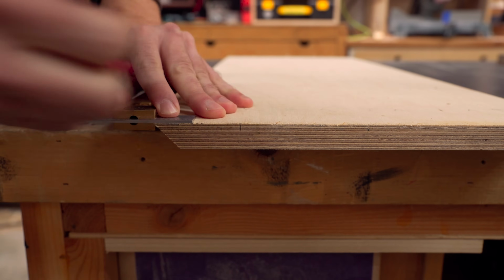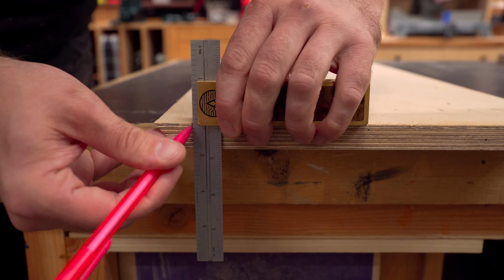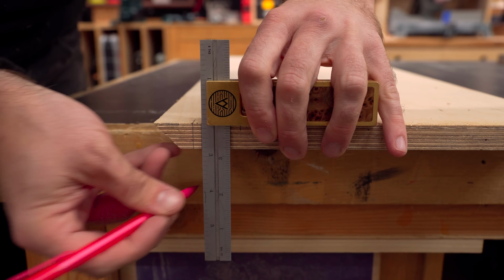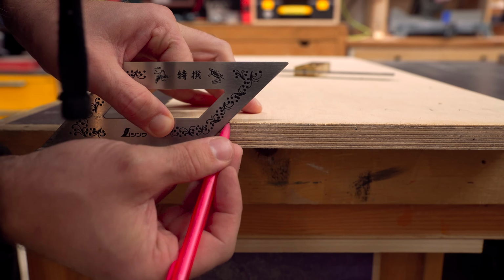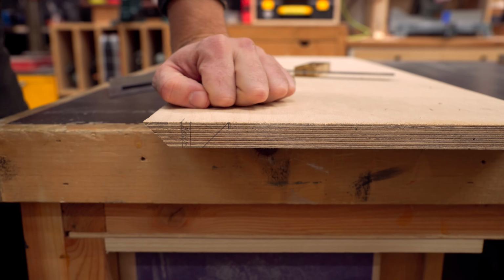With a 45-degree angle on the outside edge, I can start making a couple measurements. Basically, I'm gonna get 2 pieces out of every rip cut. I don't wanna switch back and forth between 90 and 45 degrees on my table saw, so I cut out 2 at a time and then allow a middle section of a 1/4 inch, which will be plenty of room for a curve cut later when I go to rip the strips in half.